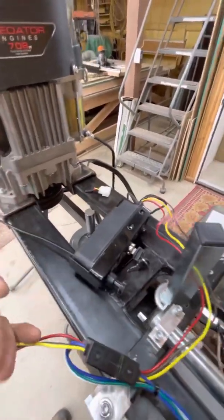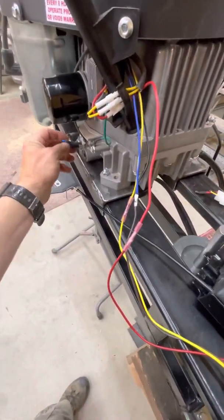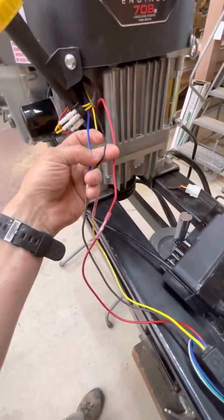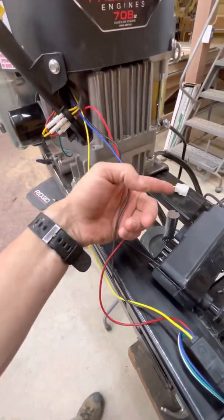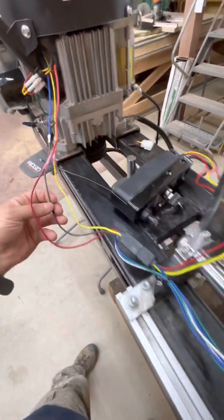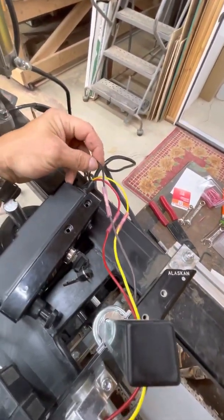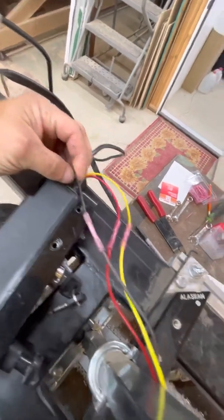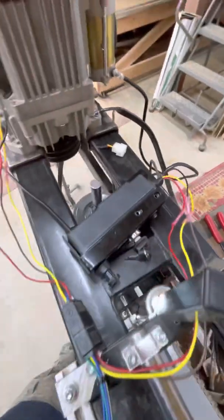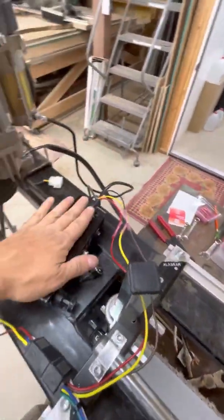Basically, the major wires — all you've got to worry about now are the start. With this blue low oil wire coming up, the blue ties in with this black wire that was cut off of the junction block. I spliced them together, ran it through my harness, and that connects onto this ignition switch — the black with red stripe, if you can see that.